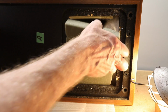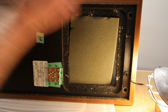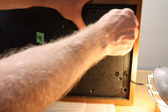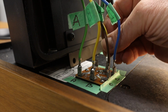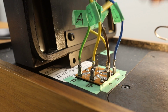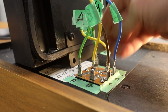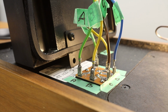The insulation goes back into the upper cavity and the upper access panel is screwed into place. Place the mid-range tweeter enclosure on its end on top of the main speaker and reattach the 6 wires to the small circuit board. Ensure the wires are connected to the correct posts. Attach the upper enclosure to the main speaker. We're almost finished.